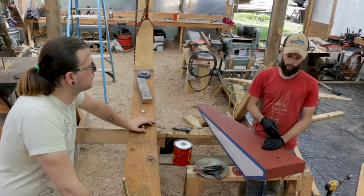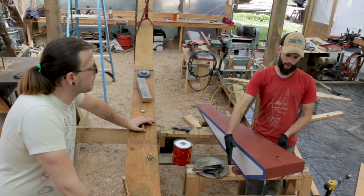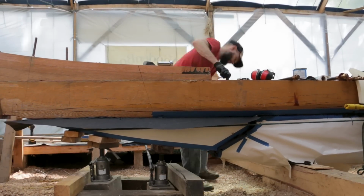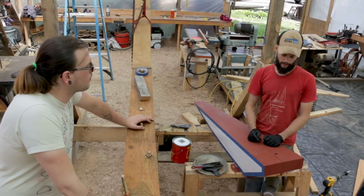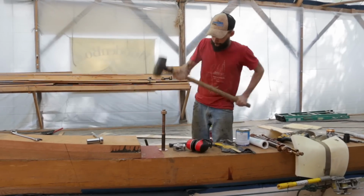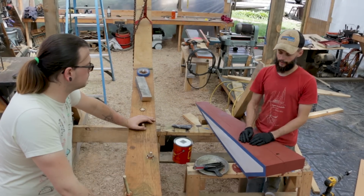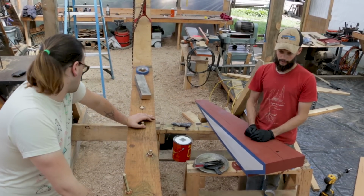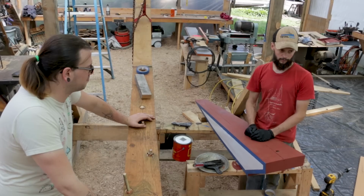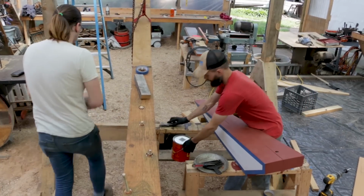And then we'll probably have to tap it a bit with a board and the sledgehammer and play with it until we get the holes to line up. And then once we have the holes all lined up, we'll drive that rear bolt home. And then at that point we can worry about aligning the front. We'll move the jacks around a little bit and then we'll do the drilling. Sounds good. Any questions? Good. We'll get some gloves.